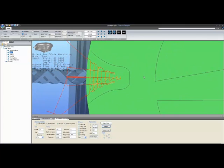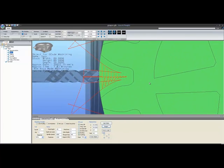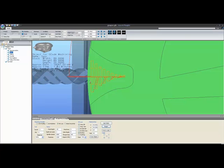clear it out. I did have many requests in Gearotic that you could use maybe a bigger tool to do your rooting and a finer tool to do your toothing. And this is why you can turn off rooting or toothing. So what I could do is turn off toothing, leave it as a rooting path with one particular size of tool, and save that as an output file with post code. This will post a code label with a name of spur